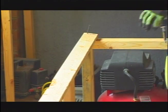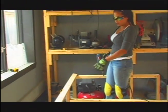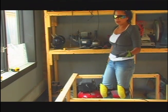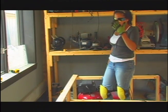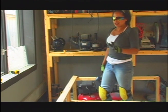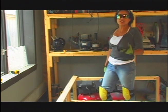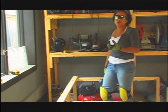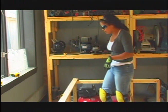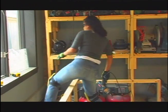As you can see, this board here is a little warped. When you go to your lumber yard or supply center, you've got to look at every piece. Strapping comes in bundles so it's really hard to check every individual piece — some of them are going to bow a little. We're going to try and fix that as we're screwing it to the frame.